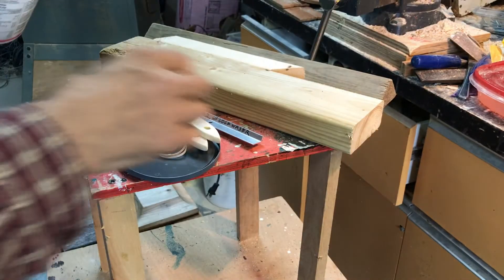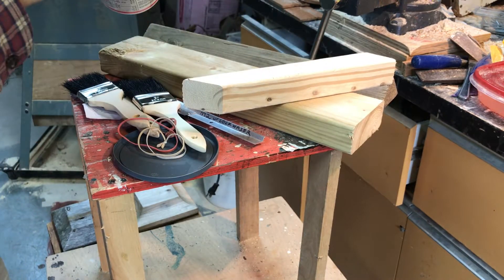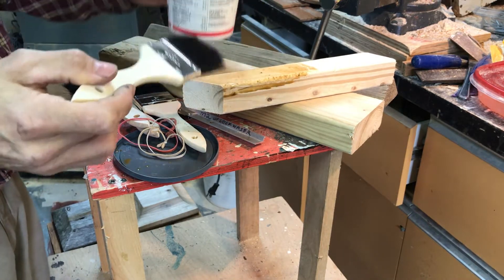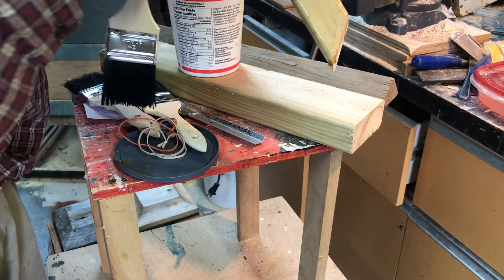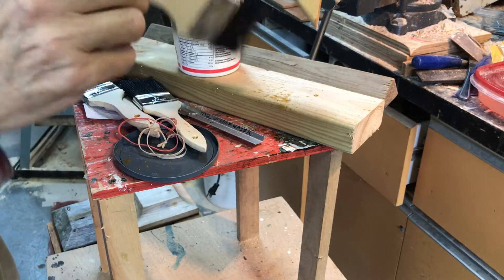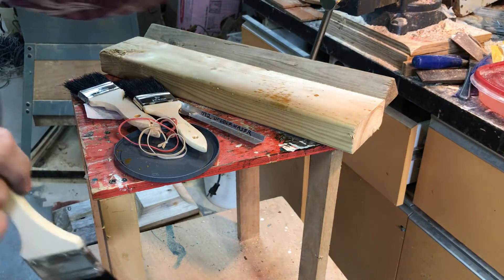The first thing is I don't really want to spend much time on the silvery patina, but I'll show you what it looks like. We'll start with this piece of trim — just some one-by pine SPF, not treated at all. I've had this stuff in a jar for about two years. Before you stain a deck with this stuff you would definitely give it a quick sand to break the surface. That is not changing color at all yet, but anyway let's look at the colors.